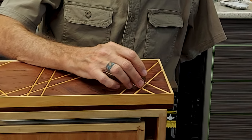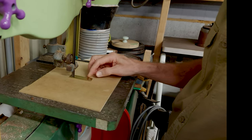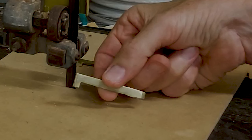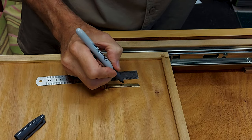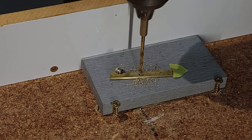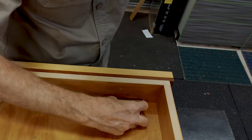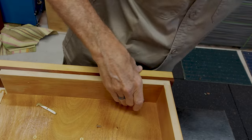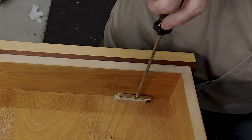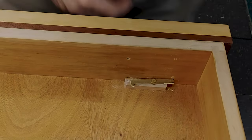As you can see, it worked perfectly. Now it's time to make the latch. I started with a piece of 2mm thick brass plate salvaged from an old lock. I cut it into the shape of a long hook on the bandsaw and filed the edges smooth off camera. The next step was to drill a hole in the middle of the hook to act as a pivot point for the latch. For the hook to line up with the pushrod and engage the secret drawer it had to be lifted 10mm, so I glued a small riser block into the underneath of the main drawer. After attaching the hook to the riser block I tested the pushrod to make sure it engaged the back of the hook — and it did.